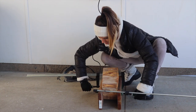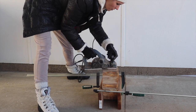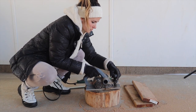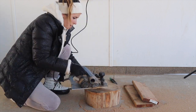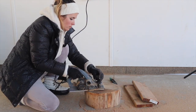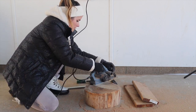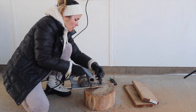On all of the edges, I just basically mocked up this clamp system, very similar to what I was doing when I was chainsawing — sandwiching the wood between boards and then clamping those boards in place so that the piece of wood can't move when you're coming across it with your power tools. Planing did wonders for this wood cookie, especially on the flat surface on top. I got it extremely smooth by taking off almost an eighth of an inch with the hand planer at first to get it mostly straight across, and then I got rid of my planing marks by taking it down to a very minimal amount and running it all different directions across the top of the wood cookie. A planer of some sort is now on my tool wish list, for sure.